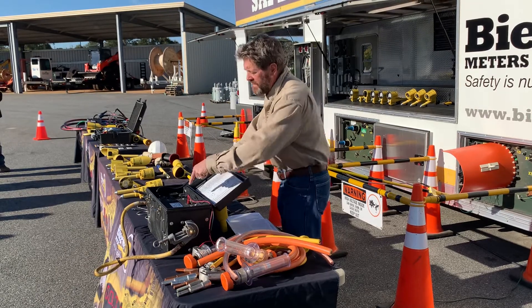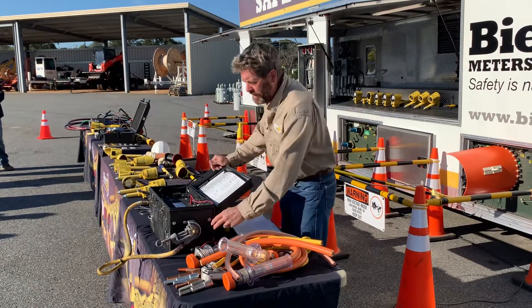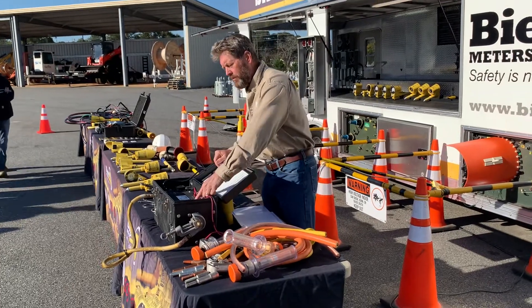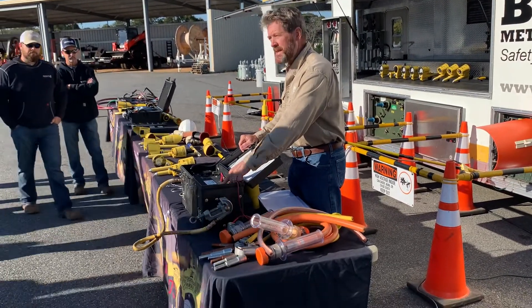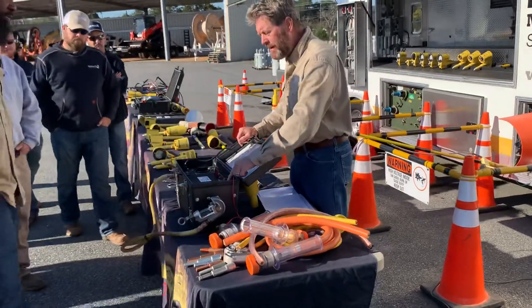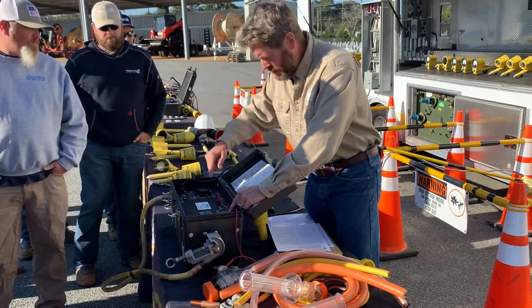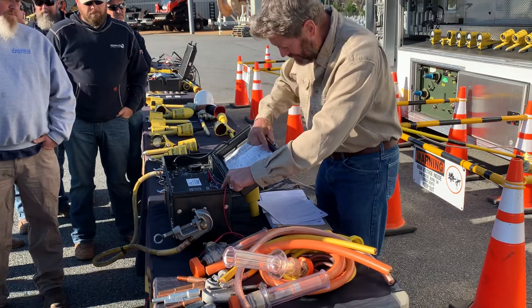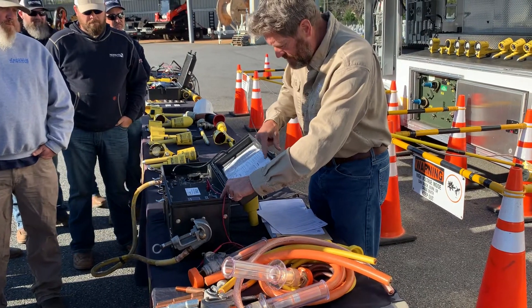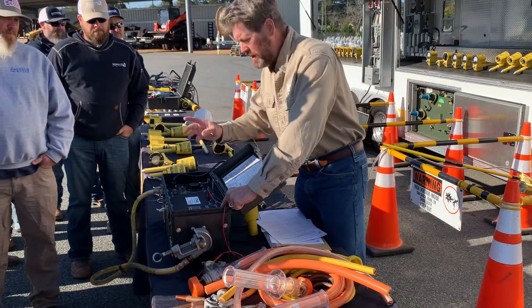This unit puts up to 600 amps. If you want to gather around, we'll do it real quick. We have a current meter right here at the bottom, a voltage drop meter right here, and four-foot, two-aught cable. The ASTM table one standard says that you've got to put 300 amps on that.